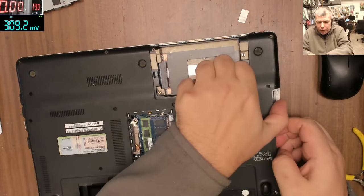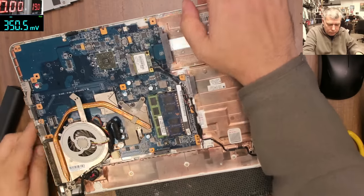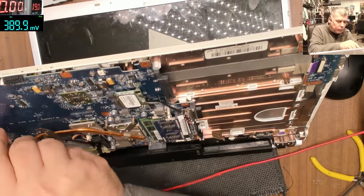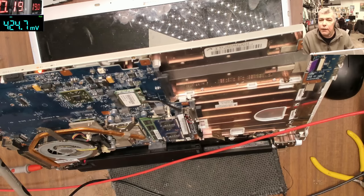You know what we didn't check, one second, we didn't check the battery and the charging. Why did the customer say it's charging slowly? Let's put back the battery. Power supply. Taking 200 milliamps. Let's wait. I can bet, you know, the customer has a dodgy charger, because I saw 2 amps. Battery was charging with 2 amps. Well, let's wait. Probably it takes a while to start charging.